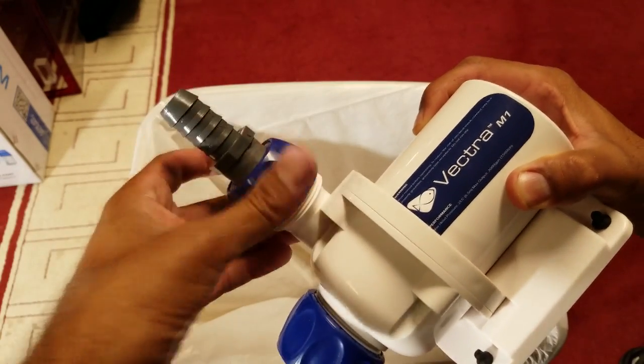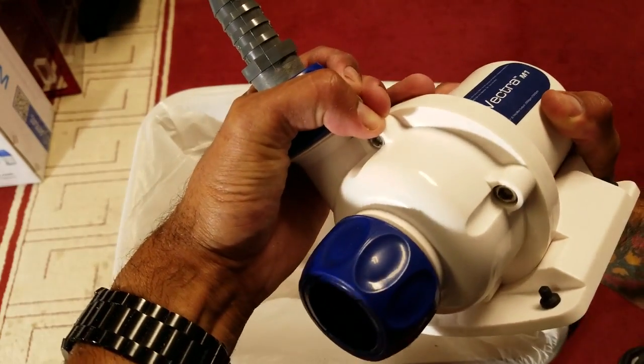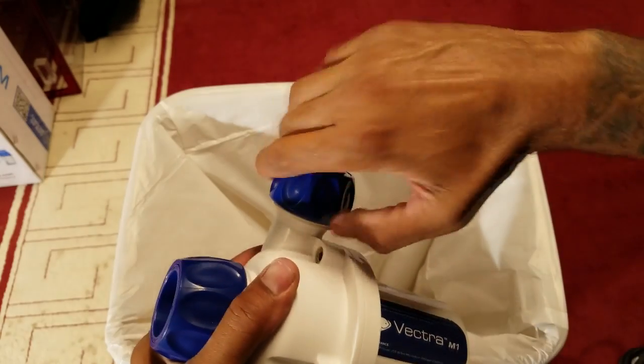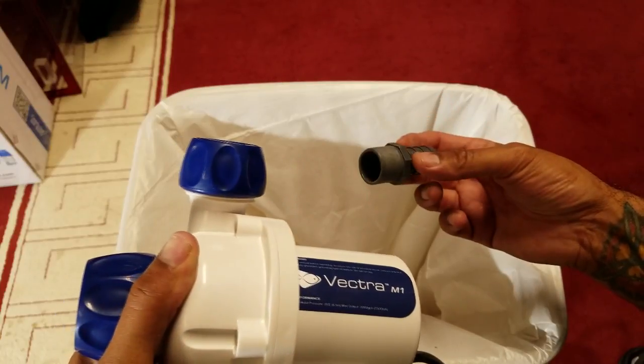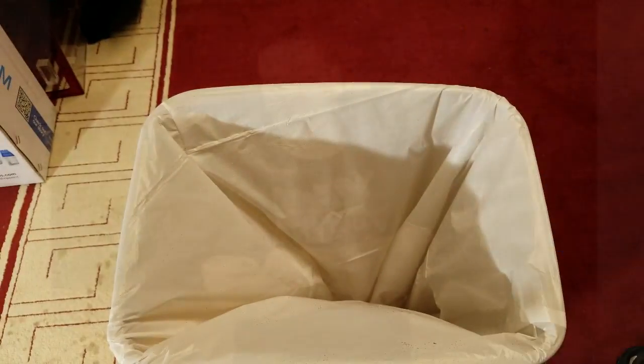The compression alone is supposed to hold the PVC in place. As you can see, this is not the case. Even with the hose barb sanded down to size, if you don't use glue, the barb will easily fall out with any sort of sideways pressure. You can imagine what the water damage would look like if the fitting shot out and allowed the pump to spray water all over the inside of your tank stand.